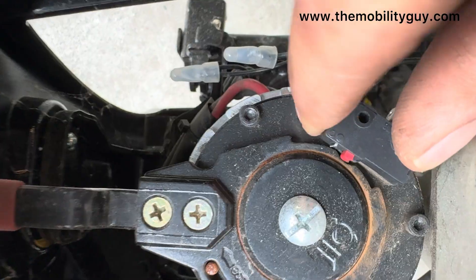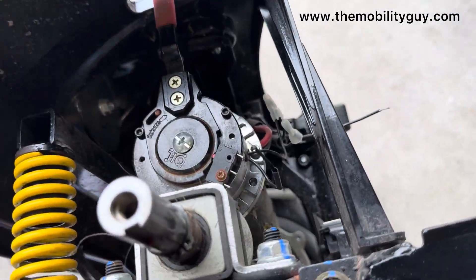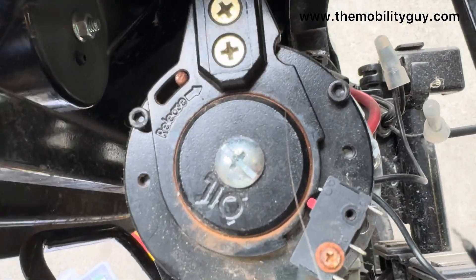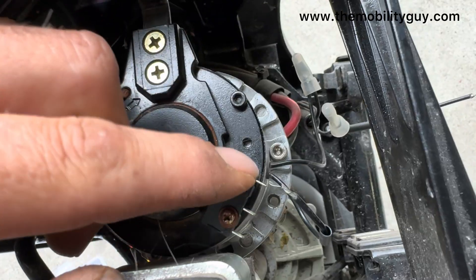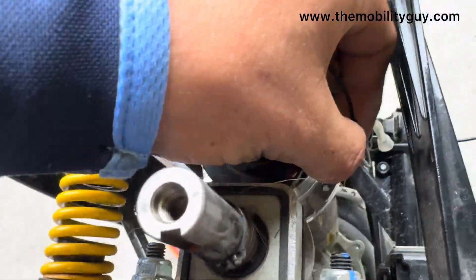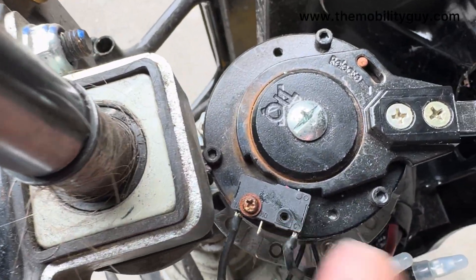It's the same switch — there was a lever on the old one, I've just popped it off, it's the only one I had. So I'm taking the old one off and putting this one on. Also worth noting: that isn't a missing hole, that's a receiver — it has to be pressed down. The new switch is in there. Now I'm going to solder a wire here and a wire there. Some will go one side and middle — always on or always off. I've got some shrink wrap around this to keep it away from the solder joints.